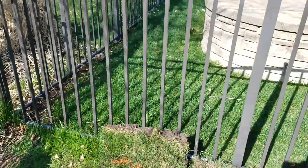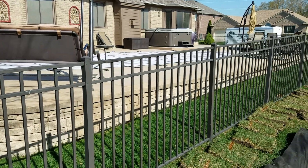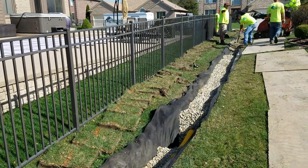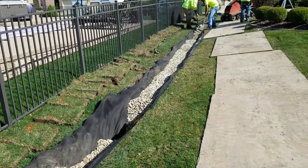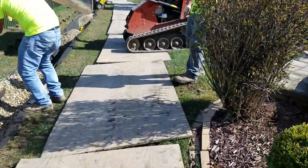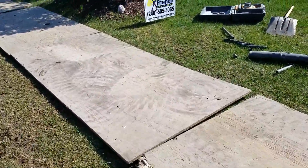I also wanted to point out these low areas, these collection areas. Here's a great example: we built these outdoor living spaces in the backyard and all the water has to shed off of them, and then it's in a highly concentrated swale that we usually share with a neighboring property. This is why we end up with a lot of water in concentrated areas — usually on the side of homes or in the back on the property line.